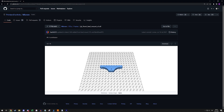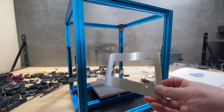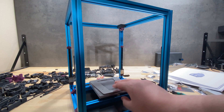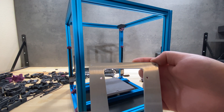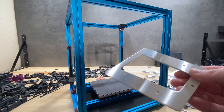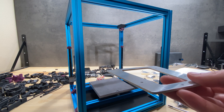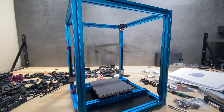This will be mounted in the next episode. I actually designed an adapter plate that goes under the bed in the correct orientation, letting you screw the bed in with the extrusions in the right place. But the problem was I didn't account for the clearance of the Sexbolt Z limit switch, so I needed a cutout around it to avoid interference. I didn't do that, so the aluminium plate wasn't usable. I'd also have to modify the Sexbolt Z limit switch housing to increase its height slightly anyway, so this is how I had to mount it — but functionally it shouldn't really matter.